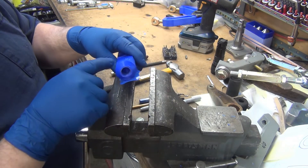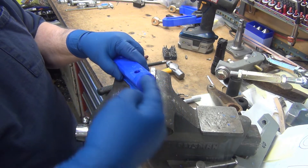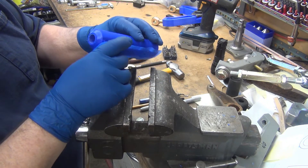If I would have thought about it, I would have modified the model and made that hole go all the way through as a pass-through for clearance on that tap, since that's not a bottoming tap.